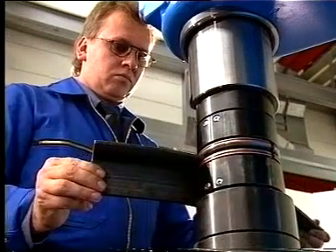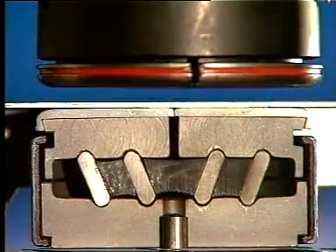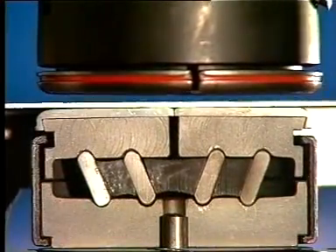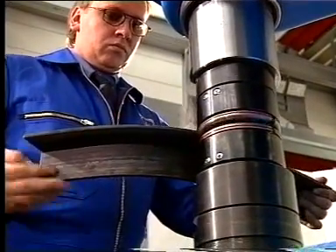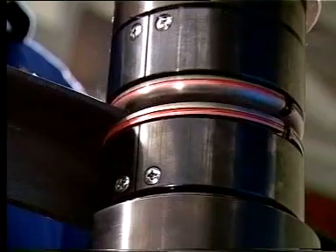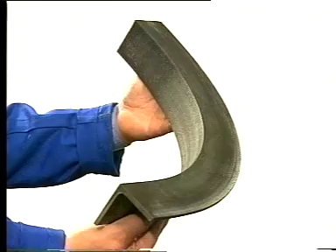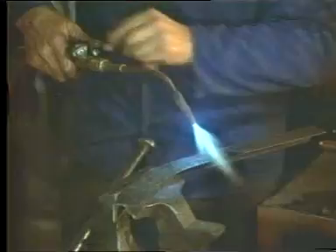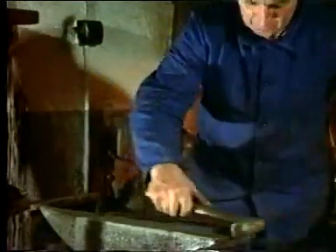In stretching, the tool elements work from the middle outwards as they stretch the workpiece material precisely step by step to the desired form. The corrugated and hardened upper surfaces of the tooling elements grip the material and force it into the stretching direction. A flashback shows the conventional, but now almost historical, method of heat shrinking with bending and beating out the wrinkles in a series of time-consuming operations.